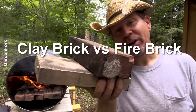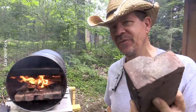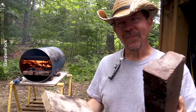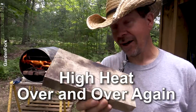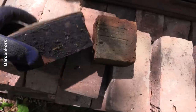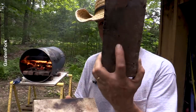Clay brick versus fire brick. My big mantra is: use what you got. Clay brick is basically clay — it's made for building homes; it's not for fireplaces. That's what fire brick is for. It's almost pizza time. But clay brick can stand up to some heat. Fire brick is made such that it stands up to a lot of heat for a long time. The difference here is that I've built my pizza ovens out of clay brick, and what happens over time — the brick cracks from the heat. It doesn't explode on me, it cracks. And then I need some more brick. But fire brick costs money, and if you've got clay brick laying around...